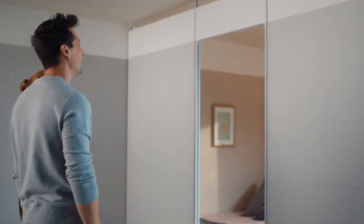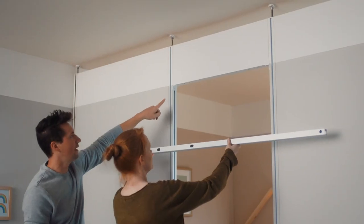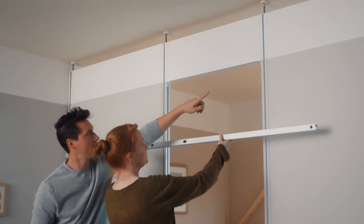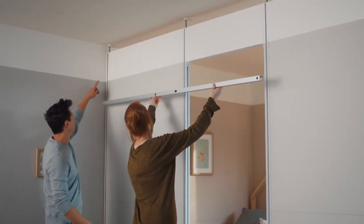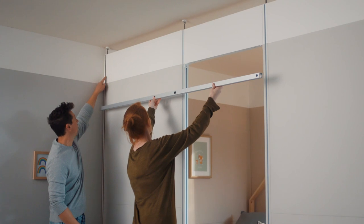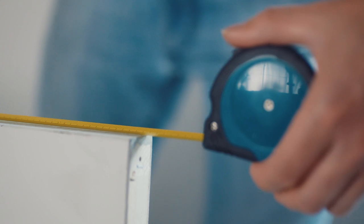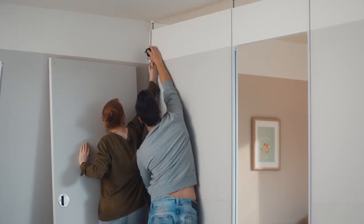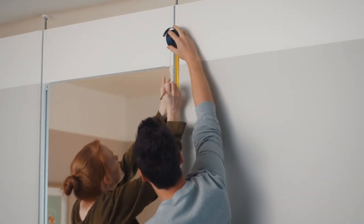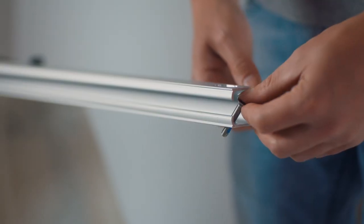The next step is to fit the rail that the door hangs on. The rail fixes into three posts: two posts directly either side of the gap for the sliding door, and also the next post with at least a one meter gap on the side that the door will open onto. Measure the height of your door, add 48 millimeters, and mark this measurement on the three posts.